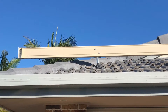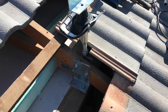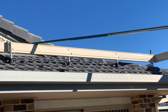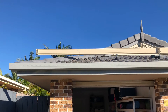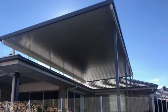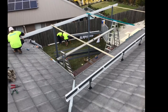You can see how we clear the hips or tiled ends, and you can also see how we penetrate the roof on a tiled roof — whether this is a standard roof extender bracket. Roof extenders are a great versatile bracket we supply in our kits. We also have a number of other roof penetration brackets for different applications where we need to get more height or want a better-looking finish, and you can see how all of the assembly goes above the house roof.